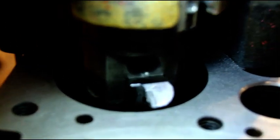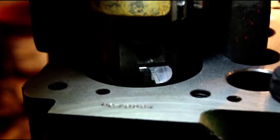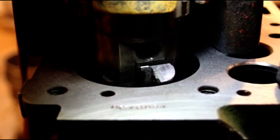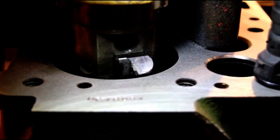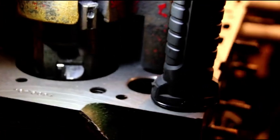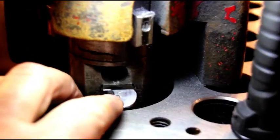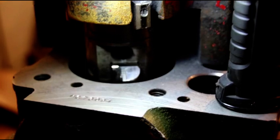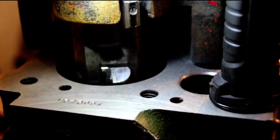We've got Gary's engine set up here with the boring bar on there and we're just getting going. I'm boring cylinder number one — it wasn't terrible. It's that number three cylinder that's way, way big. I'm cutting these in two passes: sending one cutter down to get a true hole, and then I'll finish size. This is 60 thousandths at the bottom, and it was almost 80 thousandths at the top. We'll go one, two, then four and three.